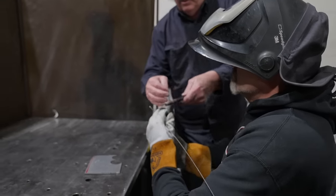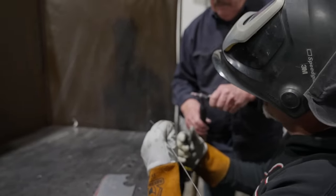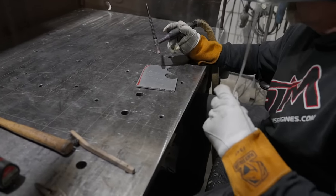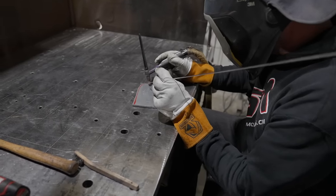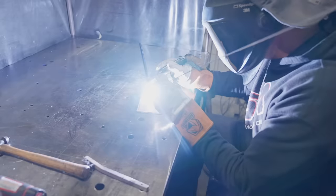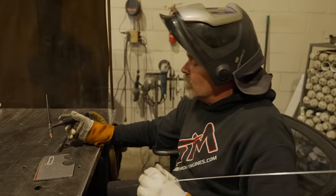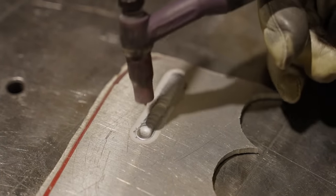Let me pull that tungsten down a little bit. I had it really tight for that O-ring weld. Okay, all right, that feels pretty normal. Okay, now that does make a nicer, tighter bead. Yes, it does. The frequency. That's simple welding, but I mean.